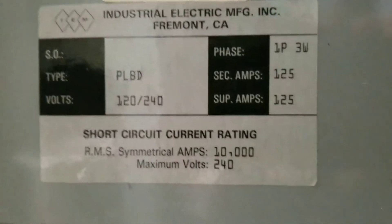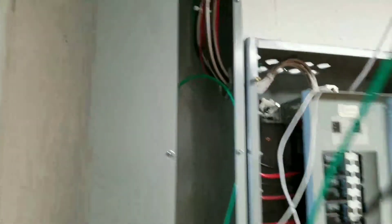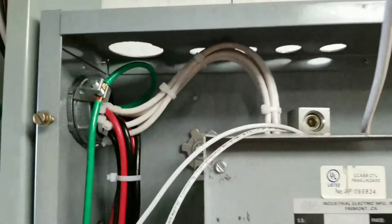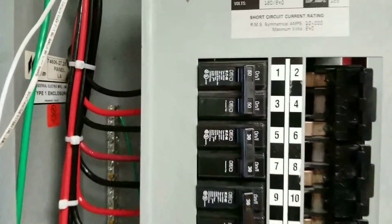I am working in the electrical room and I have my circuits in this gutter, chase through and made up. Neutrals are up here in the neutral bars, and all of our hots are coming from here. We're on 30-amp breakers because of voltage drop, so we use six-gauge wire. 50-amp breakers for the shop.